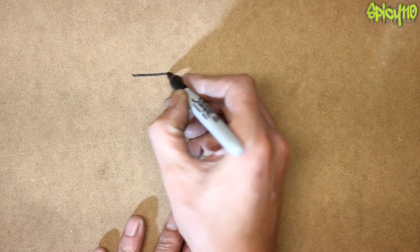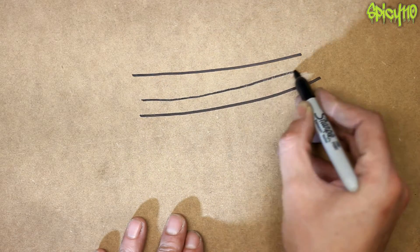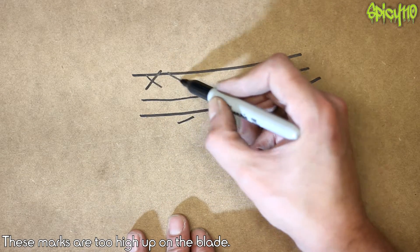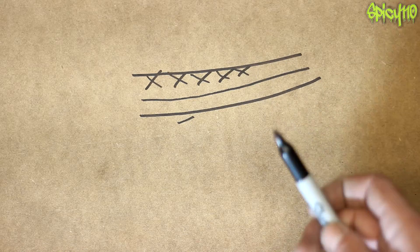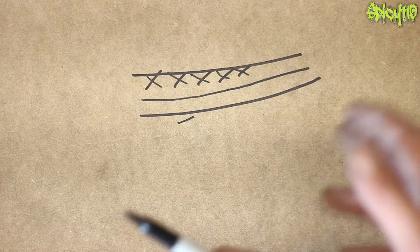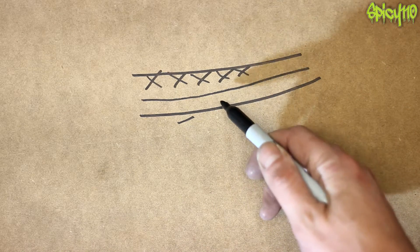To give a clear example of why you might want to change the hardness, let's take a samurai sword. Imagine this is the profile of the blade — you've got the bevel along here, this is the sharp edge, and you'll notice these weird markings along the top edge. They want to harden the front edge so it holds its edge, can be sharpened to a very nice point, and won't get dull easily. Whereas something made of lead — very soft — if you hit something with it, it keeps denting, the edge rolls over and it's not sharp anymore. Hardened steel is extremely brittle, so you don't want an entire sword made of it.